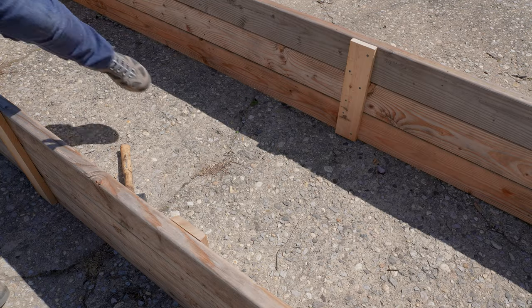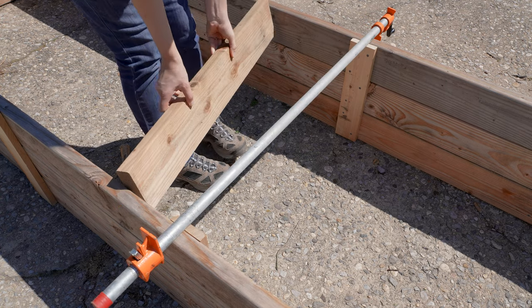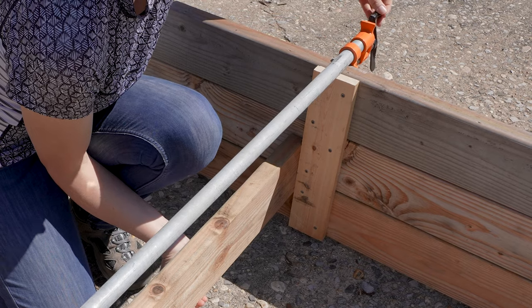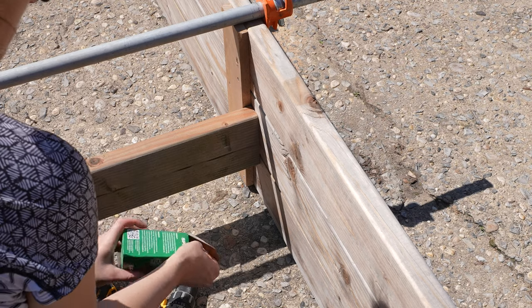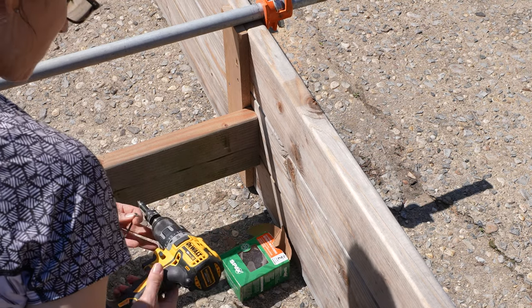Now you guys might not need internal support if your beds are shorter than 14 feet, but I can tell you mine definitely needed it. I found out that I needed bracing in my first beds because when I tried to move my first bed, it actually shifted and became a trapezoid instead of a rectangle. So yeah. Screw the board to those bracing support boards we attached to the center of the sides earlier